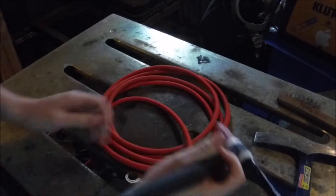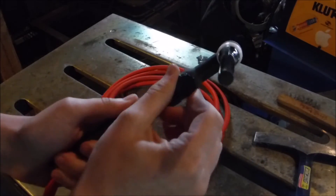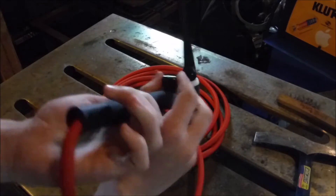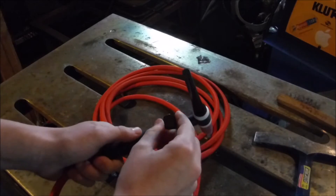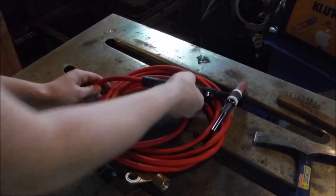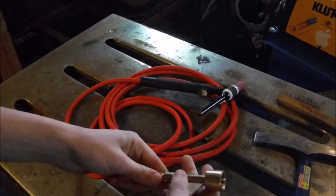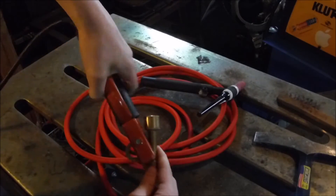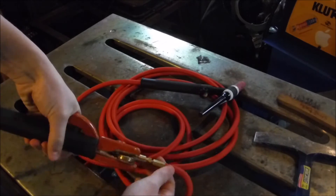Here's the torch — it's pretty standard TIG torch stuff. It's a 17 series torch, no flex head. It has this little valve on it for gas control, because since I am TIG welding using a stick welder, there is no solenoid valve in the machine — so that is how you control your gas. You open the valve and scratch off to start TIG welding. Attached to this TIG torch is a CK 12.5-foot superflex cable, which I highly recommend — it's lightweight and a blast to use. On the other end is a power block: you just take your stick electrode holder and clamp it right on, and once you turn your welder on, you have power to the TIG torch.